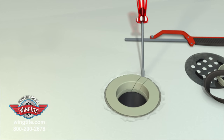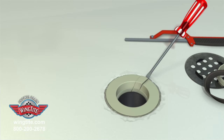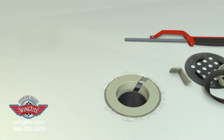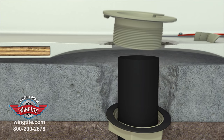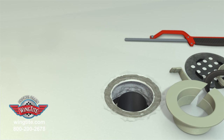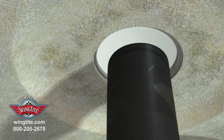With the drain body and flange cut, use the flat blade screwdriver to pry the 1-inch piece up and out, breaking it free from the shower pan. Squeeze the remaining shower drain body — this will free the retaining nut and washers below, allowing them to drop down. Remove the shower drain from the pan.